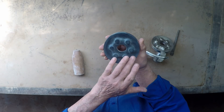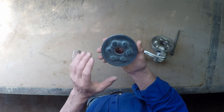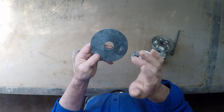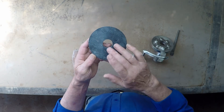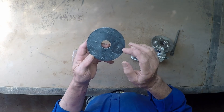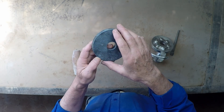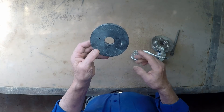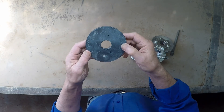This side is to be as-is, whereas this side has to be machined. So this gives me the opportunity to use this area here as where I connect the gates, the risers, etc. And because this is the face we want good, I did cast it that way down.